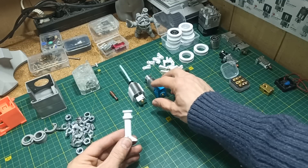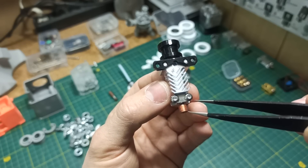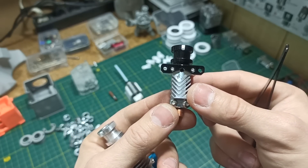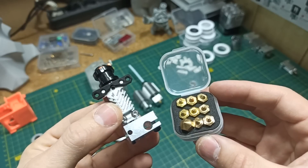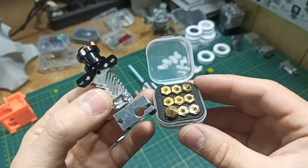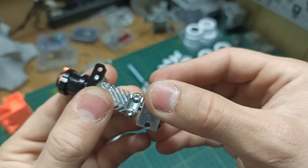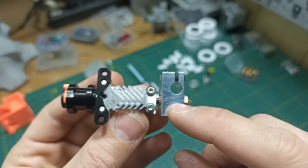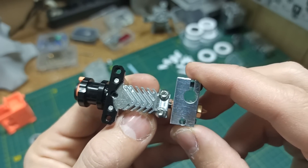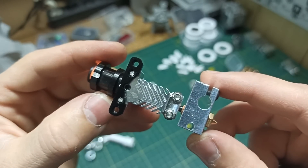Now we can move to assembling the new hotend. But this time I will be installing not the E3DV6 from Mellow Store, but the new NF Zone hotend with an aerospace thermal barrier. It uses high-temperature ceramics, which we already tested in the previous video. By the way, the mounting positions are practically identical. I'll test it and by Black Friday try to give you an answer on whether it's worth the extra cost. Many of you also ask which nozzles I use — these pointed nozzles. They are quite high quality, very precise, don't mark the part, and print quality is much better. Most importantly, the hole sizes are accurate: if 0.4, it's actually 0.4. Do not tighten by the block when using aerospace hotends or aerospace thermal barriers — the ceramics are fragile. Mellow Store even writes about this in the product description. The correct way is to position the block, hold it with a wrench, and then tighten with the nozzle itself. More details about the construction will follow in the next video during full testing.